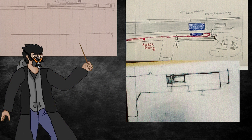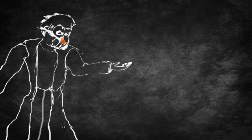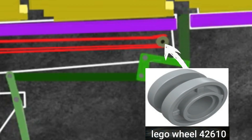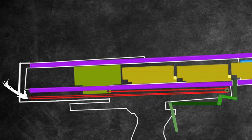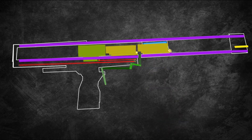When I was building it, I began to flesh out more of the details of the weapon. It looks complicated, but this is why I have animations on this channel to help you better understand. How it works is very simple. A rubber band is attached to a feeding plunger. This rubber band is looped around a pulley wheel that's also attached to the bottom back end of the tubular magazine.